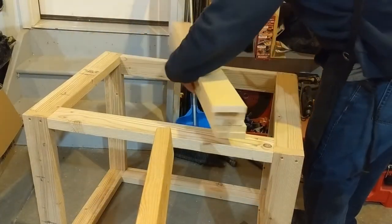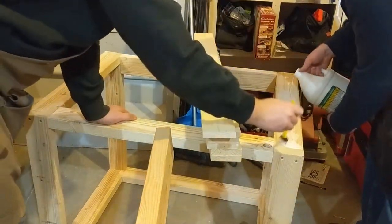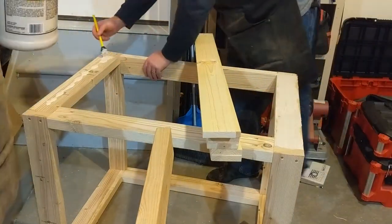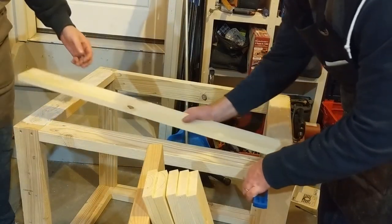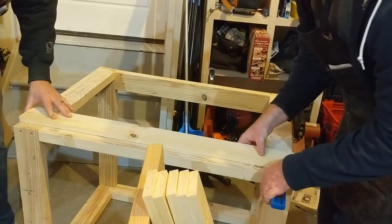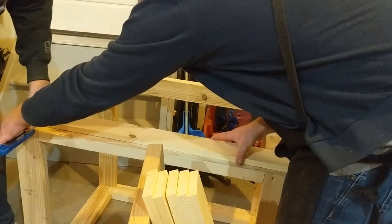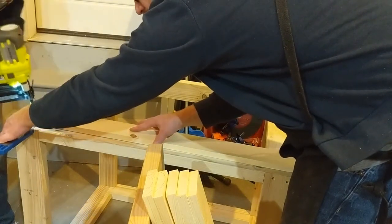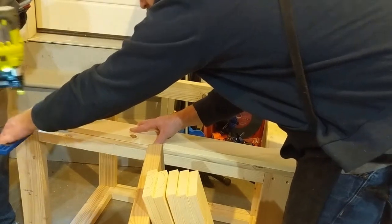From there we can start building those sides. Here we're just laying out the boards and we're going to start this glue up. We measure the top and bottom to make sure that they are square to each other before we nail this in. We initially used 18 gauge brad nailers to nail this in. Some of these boards were pretty warped though, so we ended up screwing those in later on.